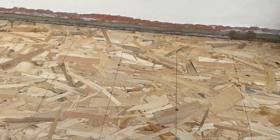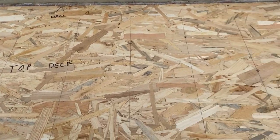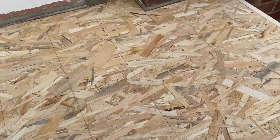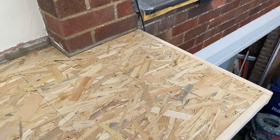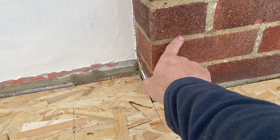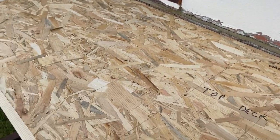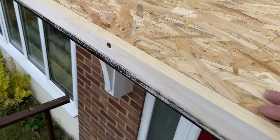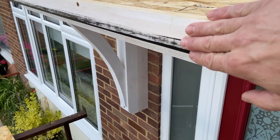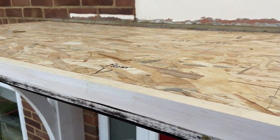Okay, so here we are. We've got this flat porch lead — it's just going to be a couple of bays on this, I think just a one wood roll bang in the middle. But first we get all the prep work done, so we take out this brick joint first, get all the mess done, then we can sweep that away. We've also got a copper drip edge on this, so we get this copper strip nailed on 25mm lower than this timber, get some building paper, some wood roll on there, and then we can get some bays.